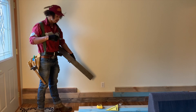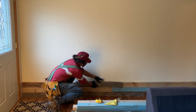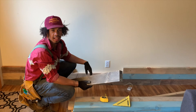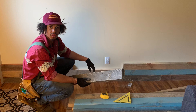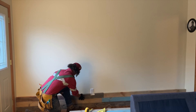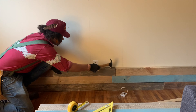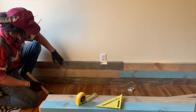I have to notch around this outlet here. I took this board and did some measuring to see where the outlet would land. I'm going to leave a little extra room on the sides because these boards are so deep you won't notice it, and if we ever have a wider plug with the outlet recessed back into the wall I'll want a little extra room. I'm going to cut this out with a jigsaw. Looks good — it fits nicely.